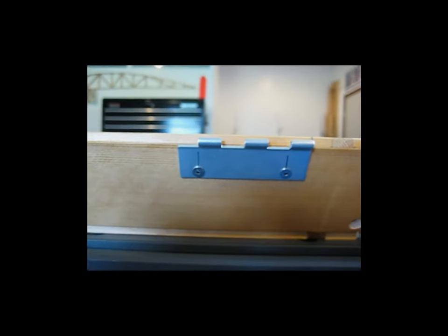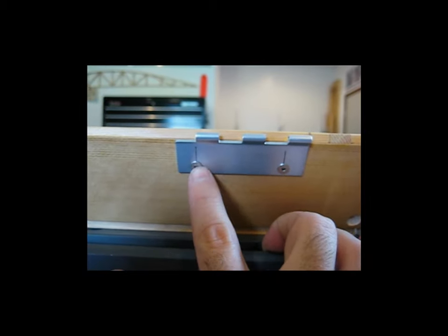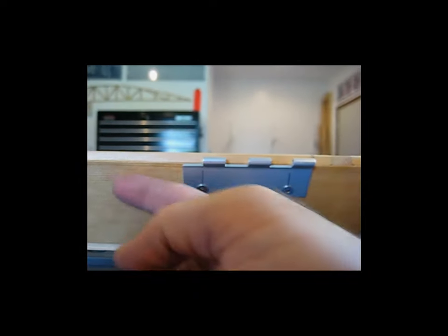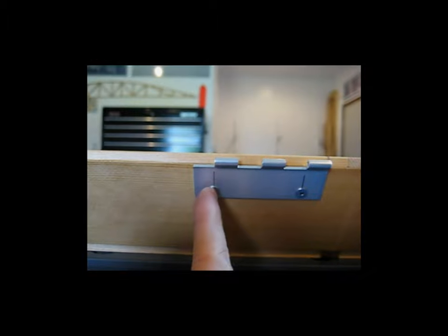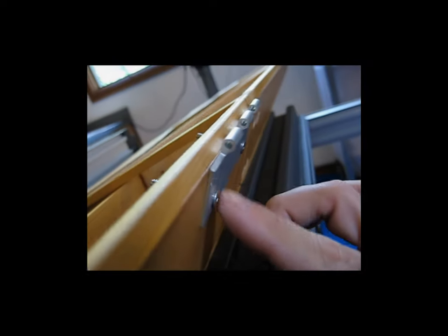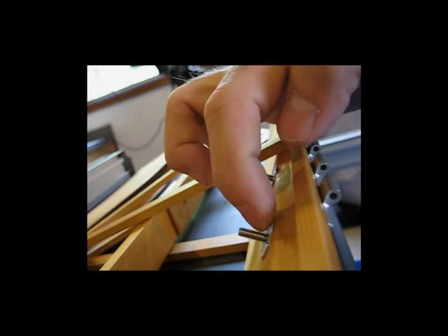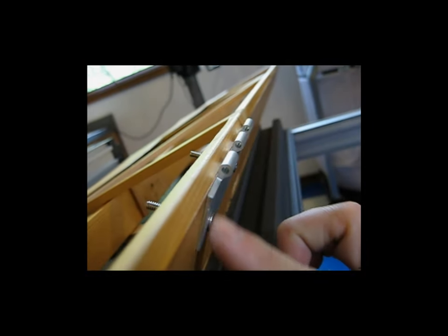You can tell that the screws for the hinge are offset — they're not centered. They're down quite a ways off-center toward the bottom, and the reason for that is because the aileron spar is at an angle. When you drill perpendicular to that angle, the backside ends up being up quite a bit, and you don't want the screw to come out there. So by lowering these down and drilling perpendicular to the spar, you still end up with a screw that comes through the entire spar.